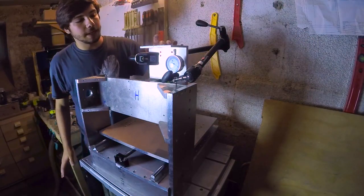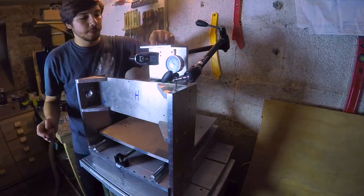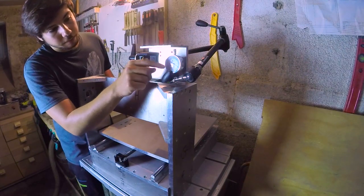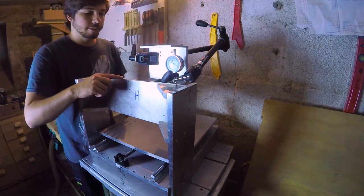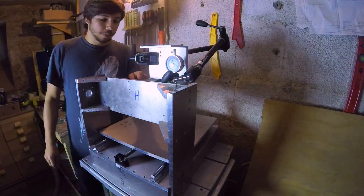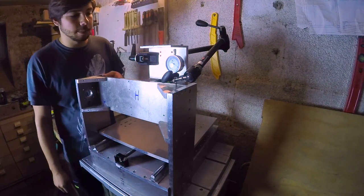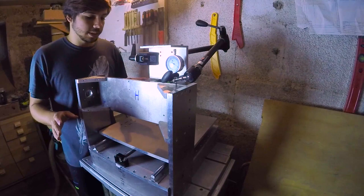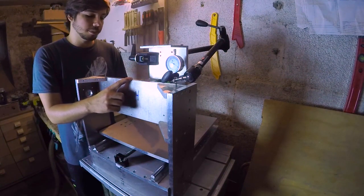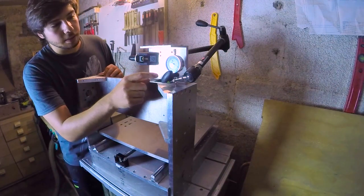Hopefully you can see my setup for the X-axis. I got the dial indicator clamped to the X-platen and it's going to ride on top of the backplate. The needle is going to wiggle around quite a bit because this is not a perfectly flat surface, but it's the best reference surface I got. The linear rails themselves are not screwed in entirely so they can wiggle around a bit so I can adjust them. My general idea is to align the top rail with the top surface, screw that in tightly, and then align the bottom one with the first one. I'm going to zoom in now so you can see the needle move.